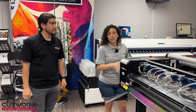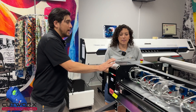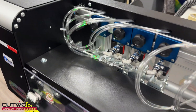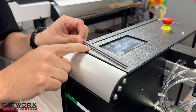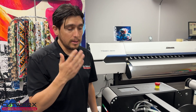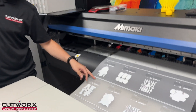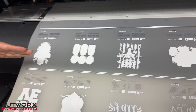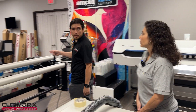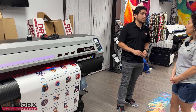Lenny, how does it know when and how to cut? That is pretty easy. Essentially you have a sensor over here, and you tell the sensor what to read. The sensor will read two lines, and that's the only thing you have to add to your print file — two lines about two millimeters apart. The machine will read that and cut under it, on top, and then your actual print. We print the lines between prints. It will read black and white lines and black lines.